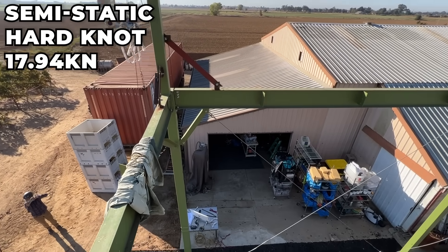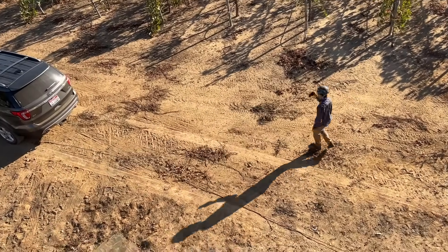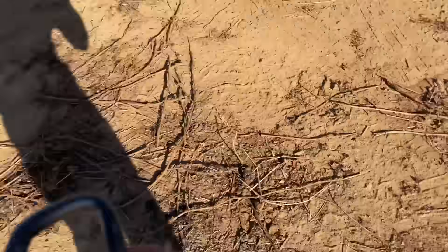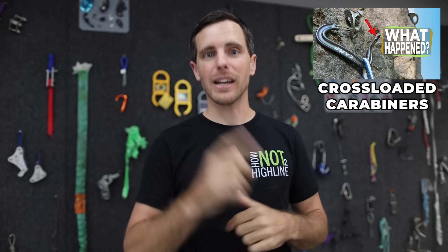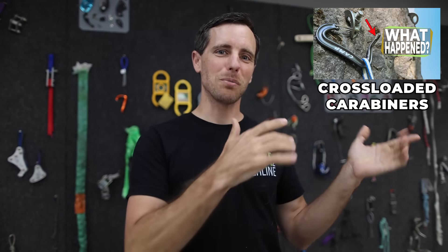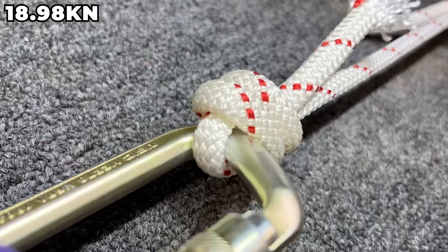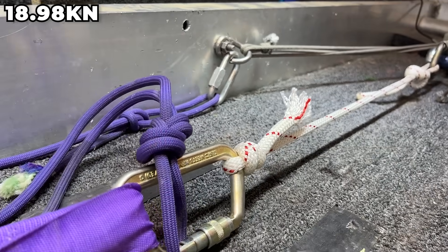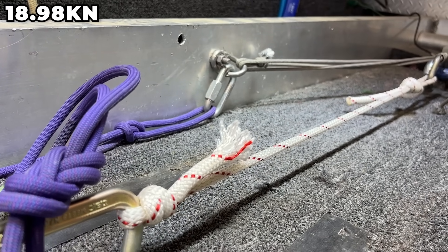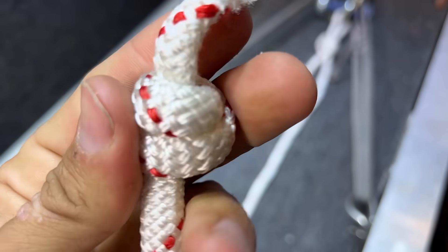On the next drop I thought the rope broke, but it didn't — it was a metal carabiner gate that broke from cross-loading. The rope itself didn't break. I've broken a remarkable number of steel carabiners in the drop tower from cross-loading. This is a real-life example of what happens when a carabiner doesn't pull along the spine where the strength is. A slow pull of the 10.0 semi-static rope gave 18.98 kilonewtons — I've gotten 17.5 to 19 on this channel — which is pretty much where the carabiner broke cross-loaded.